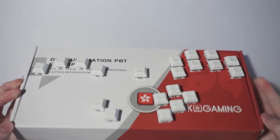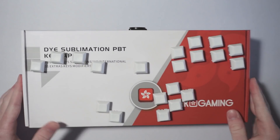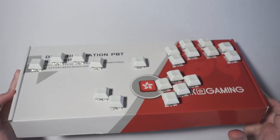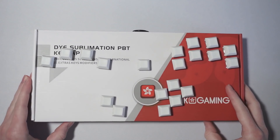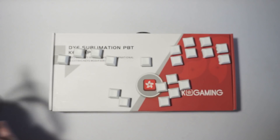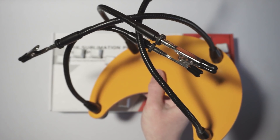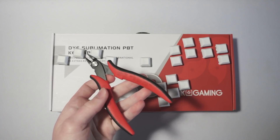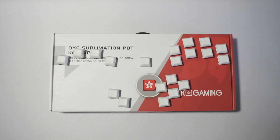Finally, you'll need some case to build it in. I just chose a cardboard box from some keycaps I bought a while ago. It needs to be big enough to fit a layout, and thick enough to house the components. If you're looking for something more durable than cardboard, there are lots of other options out there. I'll be explaining options for all of these different parts on my website soon, and I'll post an announcement in my Discord server when that is done. As for the tools, I'm going to be using a Hakko FX888D soldering station, some cheap quad helping hands from Amazon, an X-Acto knife, tweezers, flush cutters, and wire strippers. I'll have links to the tools I use in the description.